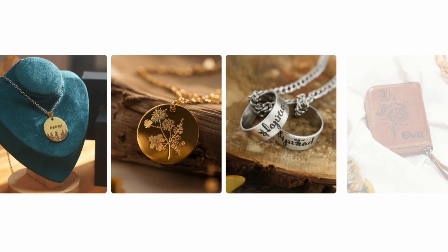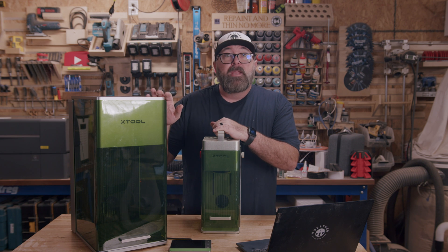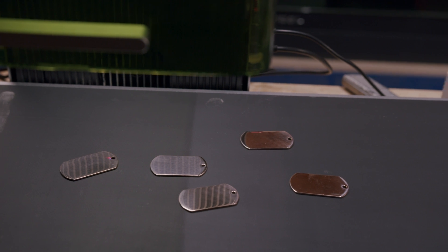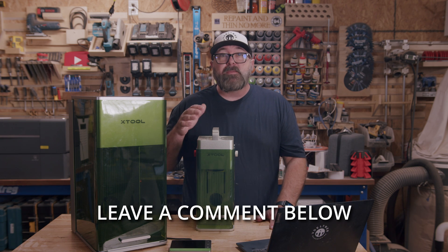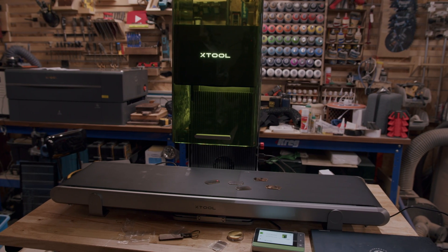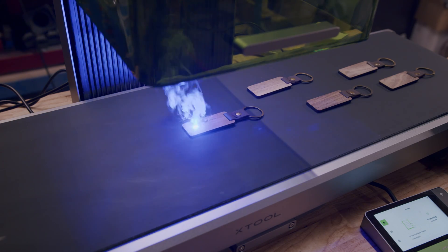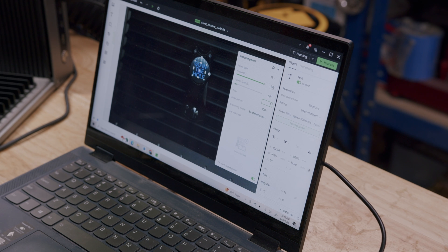On the metal engraving, the original F1 could really only simulate a 3D engraving because it was more of a surface etching. But since the F1 Ultra uses fiber, you can actually engrave into the metals. I'm planning a follow-up video on this laser where I'll be testing out the functionality as part of my official review, so here's where I need your help — leave a comment below with ideas on how you would use this laser and I'll put those to the test. One thing I'm going to look at is the auto conveyor. While the work area is already quite large for a fiber laser at 220 by 220 millimeters — almost double the others out there — the work area can be extended even further with the conveyor. This is really cool and it opens up the possibility to batch out engravings, because the laser also comes with an integrated camera.